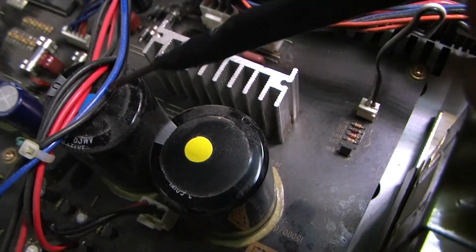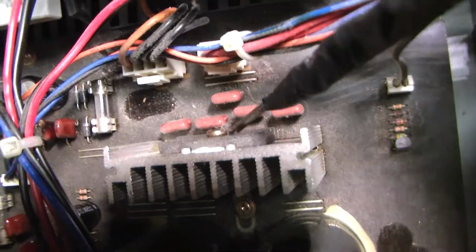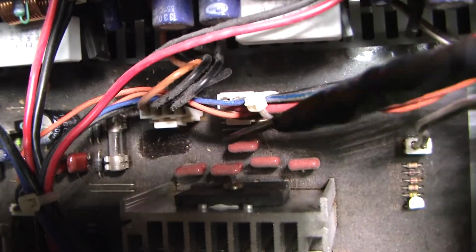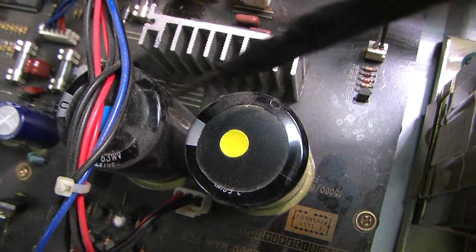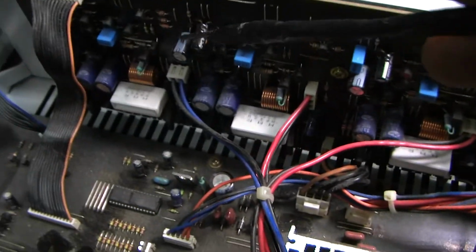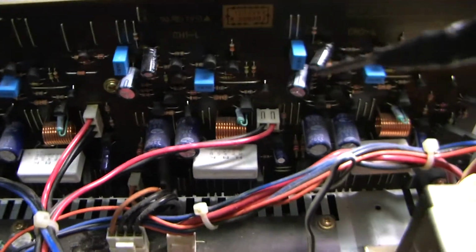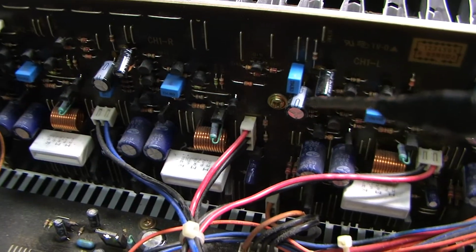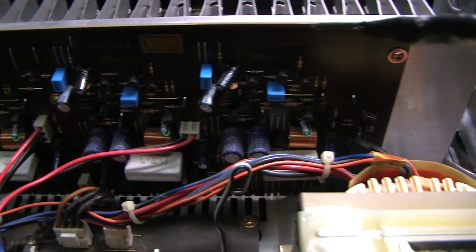So we come over, and here's our output stage. This right here, by the way, I better look before I speak. Yeah, it's a 4 terminal guy. That is a bridge rectifier. So we come in, hit the bridge rectifier, full wave rectifier, then into our capacitors, and I'm sure these go right over. This, no doubt, is the output board. You can see, I said earlier, there are 4 channels. Sorry for the shaky camera, I'm trying to hold it and do this. There are 4 discrete channels, and you can tell from the circuitry that it looks like 4 identical circuits.